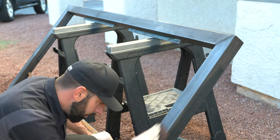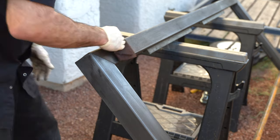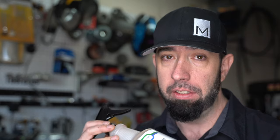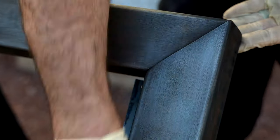The most incredible thing just happened. I decided not to film the last degreasing because it was getting redundant, but this time the microfiber towel I was using started to come apart in my hands — maybe the degreaser finally started eating the fabric. The frame was covered in fibers and bits of towel and nothing was working to remove them. So I grabbed a Scotch-Brite pad to see if that would work. It certainly did, but not without taking off some black. I realized the Scotch-Brite pad was taking off some black but bare steel started to peek through and the result was sort of a gunmetal gray wood grain and it looks amazing. It turns out this method of using an abrasive pad on the patina is actually used a lot — they call it burnishing.